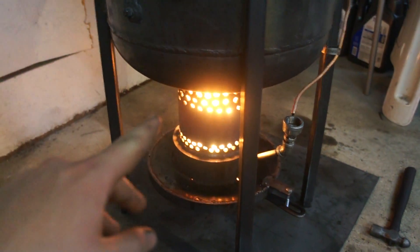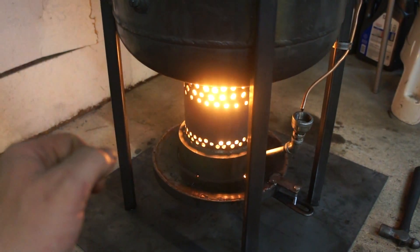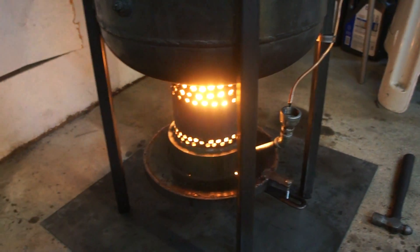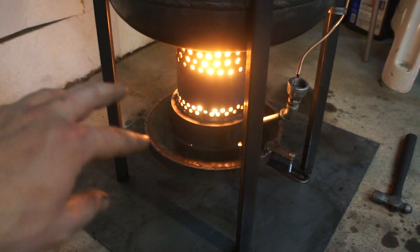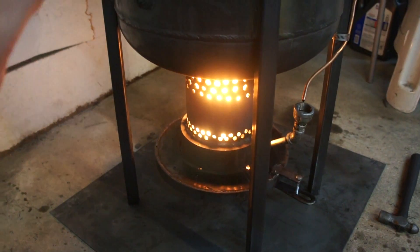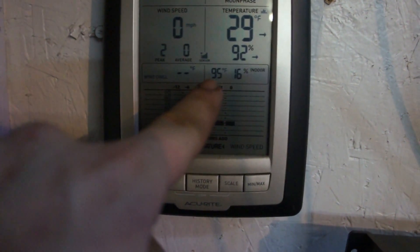Something to do with the bigger holes seems to give you better velocity versus the smaller holes. I'm still tuning to get it perfectly clean — I still have some smoke coming out of the chimney. I may also go from the 4-inch chimney up to the 6-inch chimney because we're getting a lot more heat out of this than we thought. We're running 450°F, we've seen as high as 650°F. Chimney temp around 250°F. Indoor temp 95°F, 29°F outside on the tower.